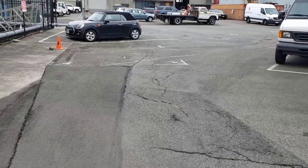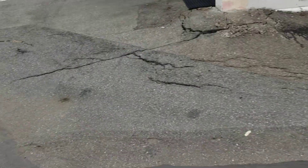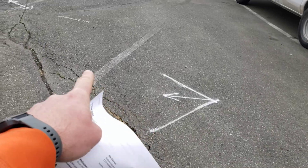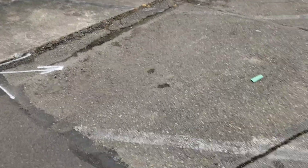Edge of the building, these big stress cracks — that's the edge of this. Something's going on here, for sure. Concrete, void in between, can't see any water or anything down there, but this definitely isn't a solid base we're working with. We're supposed to cut here. This is outside of this shelf, and I can tell it's much more solid and much less so in between the concrete dock.